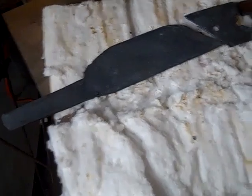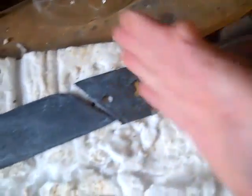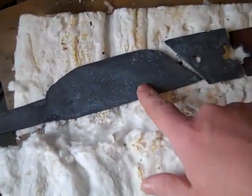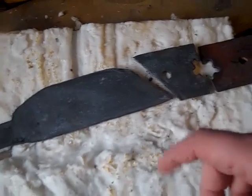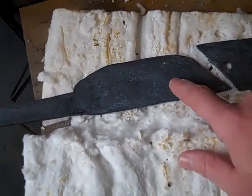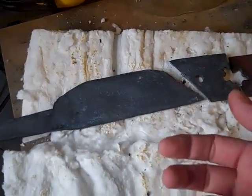I've got a little project I've been working on. I had an old lawnmower blade that was bent — I cut it in half and I've been forging on this end, mostly just to practice some skills, hammering techniques and stuff. But what I'd really like to do is find out if this is worth my time — if I can harden this, or if this is mild steel without enough carbon content to get hard. What's the point?